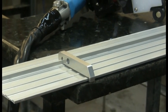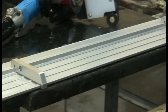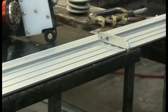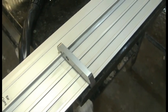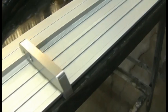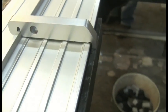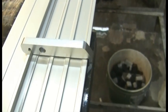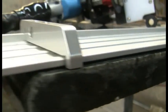Begin the process by setting up the guide rail. Place the rail along the edge you wish to dress, and place the gauge blocks on the rail, one near each end of the seam. Align the front edge of the gauge blocks with the edge of your seam. This can be either the edge of the stone or a tape line. The important thing here is that you align your stone or tape line with the front edge of the gauge blocks. The gauge blocks should not hang over and hook your slab.